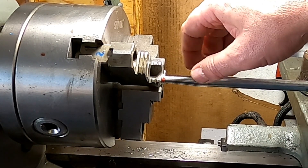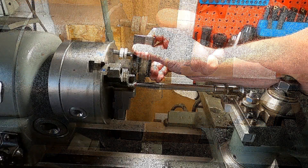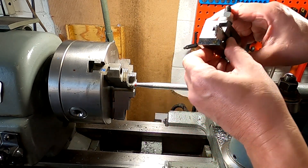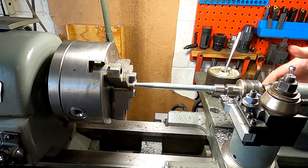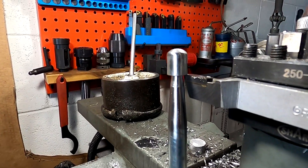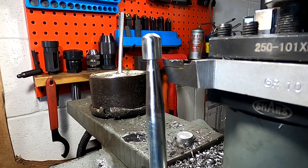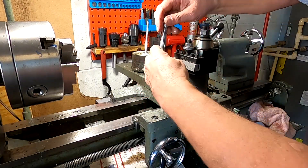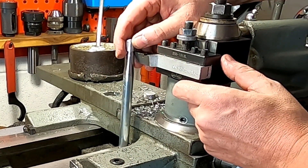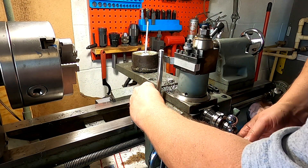This is approximately a seven degree relief, in case we're setting up for a cutoff blade which needs that space to get up under that lip. That's actually more important on the Monarch where it has a much wider cutoff tool. Let's get it out of there and see how it works. Get it right under there and back it right out — it's just skimming the bottom edge of that, very nice. Another way you could use this: if you had the tool up here like this, you could just wheel it down until it goes click and makes contact, because when that magnet hits the bed it locks right in place, giving you a perfect setting every time.